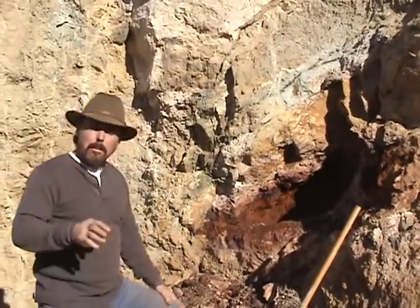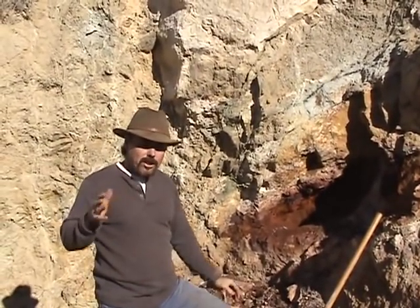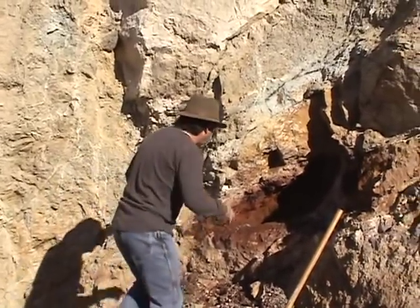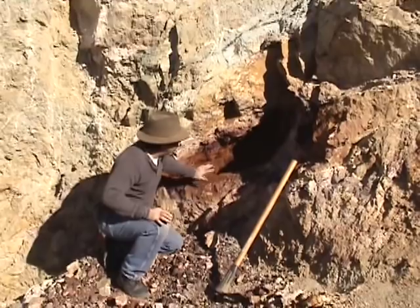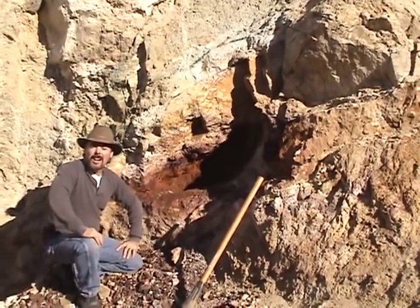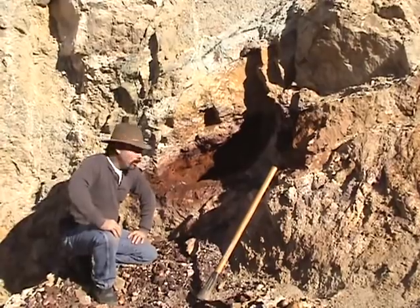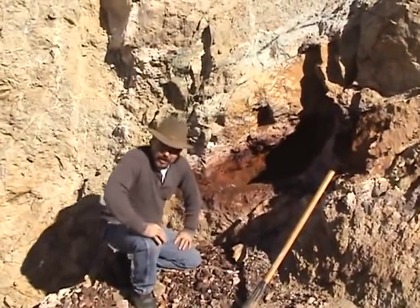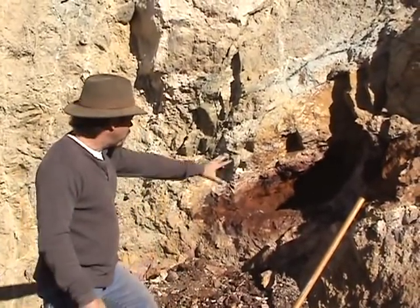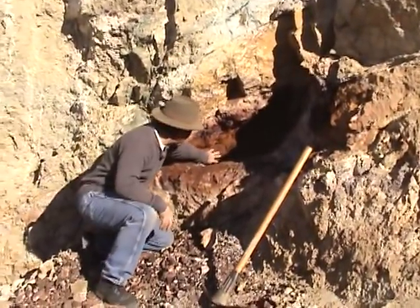Right here — this is what the old-timers were looking for. It's iron oxide, a thick vein of it, about six to eight inches thick. We tested this, and it has gold in it. This is what they were chasing. When we looked it up on the USGS report, we found out that this mine on the other side of this hill produced somewhere in the average range of two ounces per ton of rock, which is pretty good, especially at today's prices. So what we're going to do is remove a large seam of this material and run it through a dry washer or the wash plant, depending on how much moisture is locked up in here. The vein travels at a 45 degree angle, and you can see all this beautiful iron oxide in here.